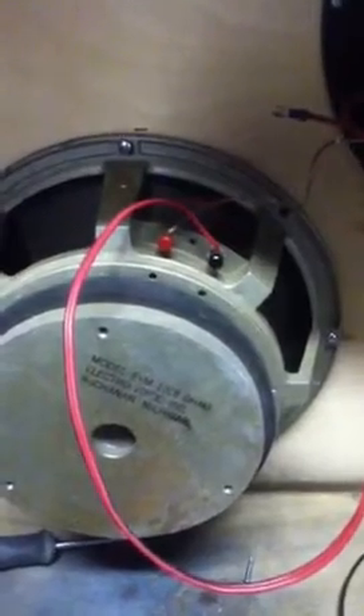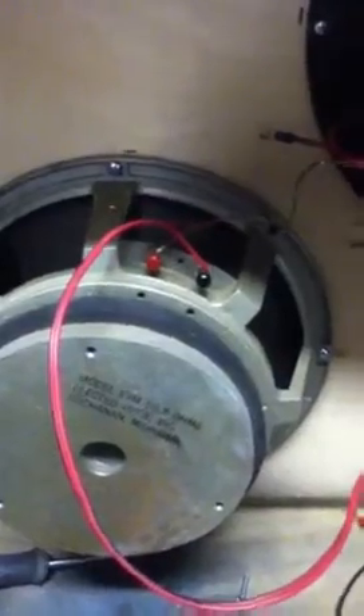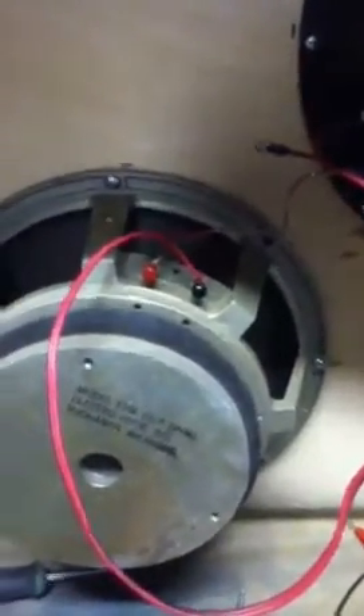It blew a 20 amp fuse because maybe it needs to draw 30 amps. I know it makes it a little bit difficult to understand, but really what the resistance has to do with — it's more like as the power flows through, how much is that speaker going to resist the flow from the amp? The amp sends power out to the speaker, but if you allow the amp to send out too much power, it's going to overheat and burn up or blow fuses or whatever.